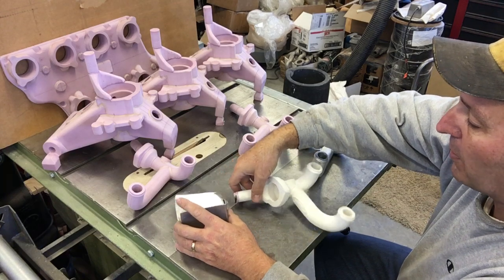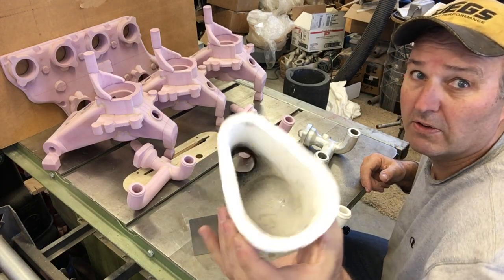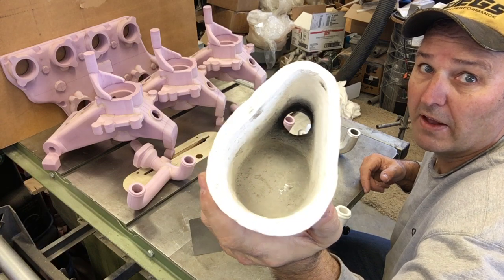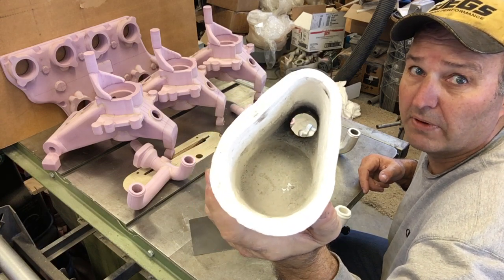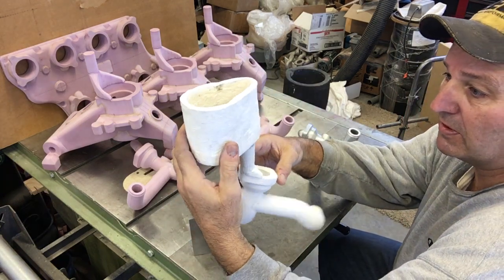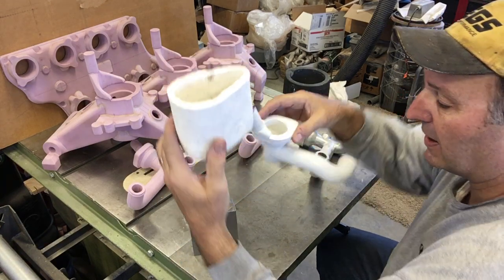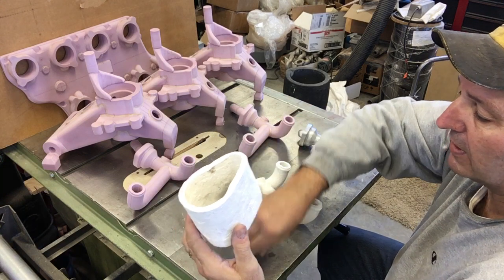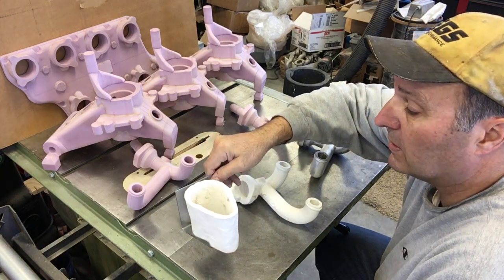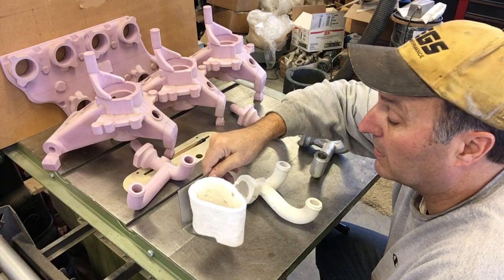This is the pouring basin. You can see it's made out of this moldable ceramic fiber. Close up, you can see it's just got the classic well step, and then that hole receives a one-inch foam sprue here on the pattern, and it'll be positioned in the mold like so. This little thing right here is just something I can grab with pliers to lift out the pouring basin afterwards while the metal is still molten, so I can dump it out and reuse it.